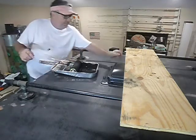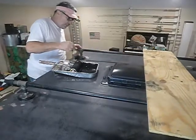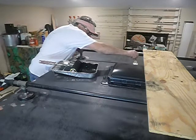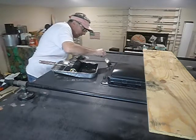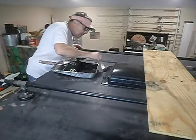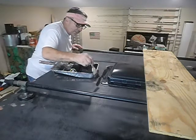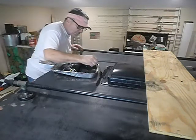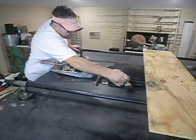So I have my roller. The first thing I want to do is take my brush and go around — this is called cutting in. I just kind of bend the brush over and jiggle it a little bit. You can actually do a wipe like that if you want, a brush stroke or whatever. But if you jiggle it a little bit like that, I guarantee you it's going to go up under that edge.